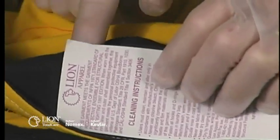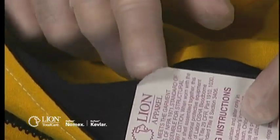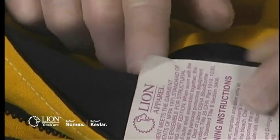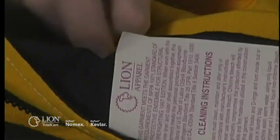Find the safety labels, cleaning instructions, and manufacturer's identification labels. They should be legible and securely affixed. Look for separation around the outer edge of the label and curling in the corners. If any are illegible, missing, or loose, note it on the inspection form and contact the manufacturer for instructions.